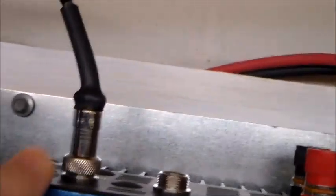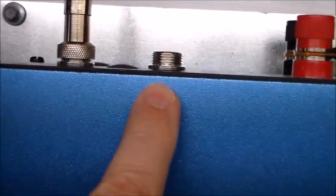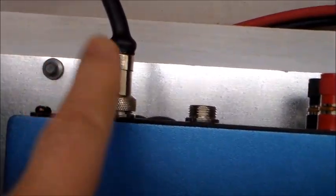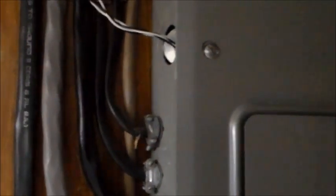The limiter utilizes this cable — there are two cable inputs. One is used if you're going to use an external limiting device, but I'm using the internal limiter built into this grid-tie inverter, so I'm connected to the internal limiter side. That goes over to a couple of wires that go into my circuit breaker panel, and that's where I have the limiter sensor clamp connected onto the legs that feed my power panel.